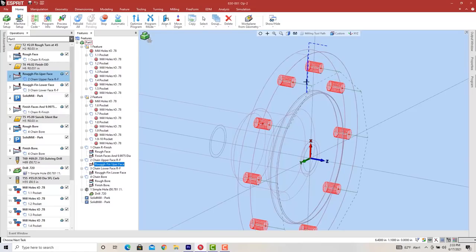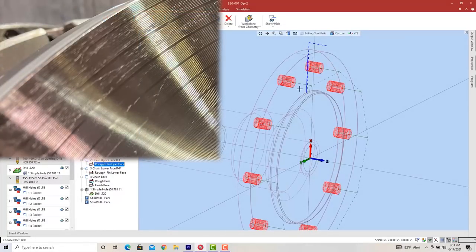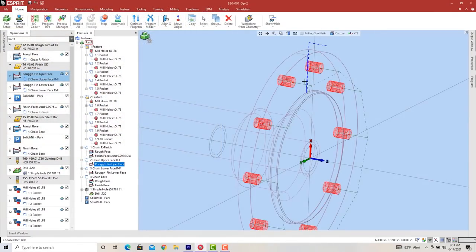And so if you leave the roughing tool marks and everything, I'll put a picture in here of that. The roughing tool takes passes down here and it leaves a wavy or bumpy surface from its passes. And that 35 degree diamond will kind of follow that contour almost, if you will. So I take these roughing passes 2/1000ths off the face. They're kind of rough finish passes, if you will. And then come back and I do a full finish pass like this all the way up the face and the diameter. But now, like I said, I changed that, and I'll show you what I did that I think is better than that. And then we rough bored it,